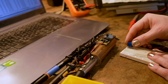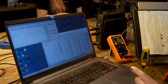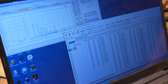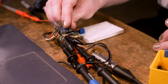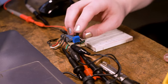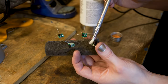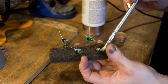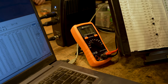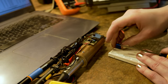The JFETs in the head board need to be biased to select the resistors that will be paired with them. A digital oscilloscope is used to determine the JFET operating point, while a spectrum analyzer ensures we minimize distortion. This process is important to get the best performance from the circuit. Once finished, these circuits are soldered, cleaned with alcohol, and coated with conformal coating to keep them sealed from moisture. All capsules are frequency tested to ensure they meet our standards for consistent response. Thirty to fifty percent of capsules are rejected at this stage.